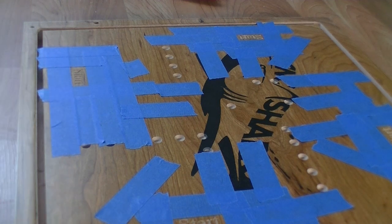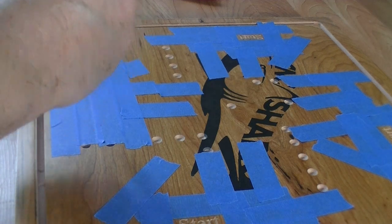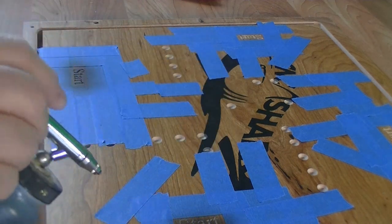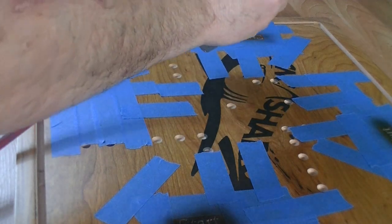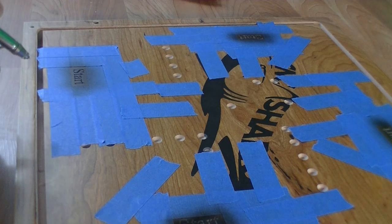Okay, I've got all of my star lettering masked off. Now I'll just start spraying with my airbrush — very, very light coats. We don't have to put a lot. What we're doing right now is just creating a seal coat so it doesn't migrate into the grain. Then we'll let that coat dry and put on another coat. We've let that coat dry, now we're going to put on another coat. Again, we want to do this lightly.